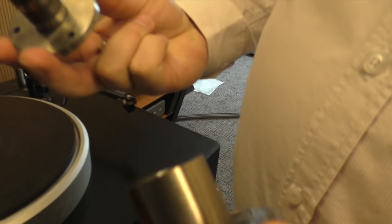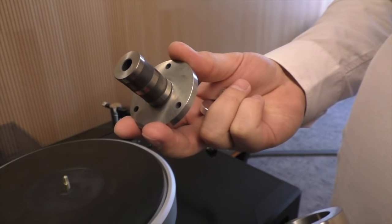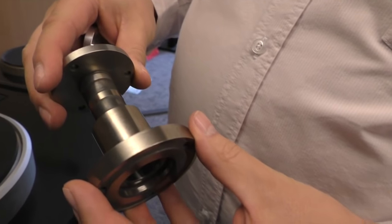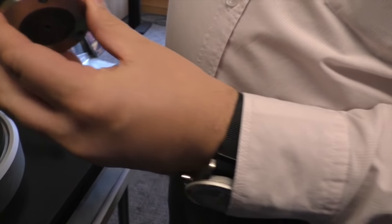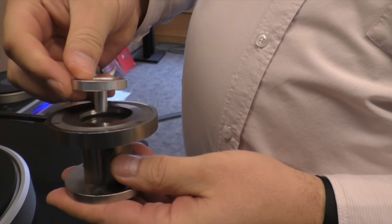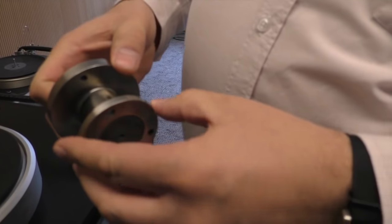It's machined from steel. It's hardened with inductive ovens, and then they put it on a special grinding machine that produces a tolerance of 5 microns. So it's actually quite precise, so there is absolutely no movement whatsoever. And this thing supports the ball. So there's a ball inside of there? A ceramic ball bearing, yeah.